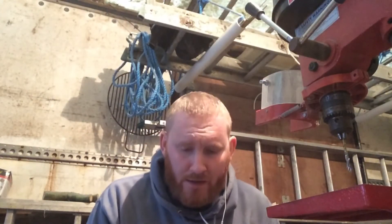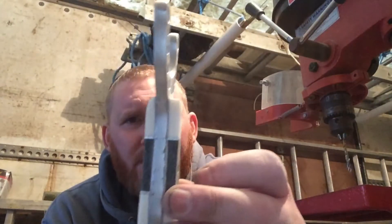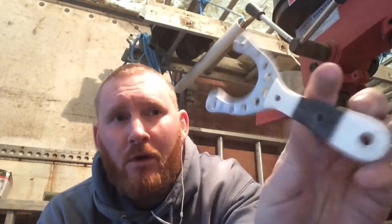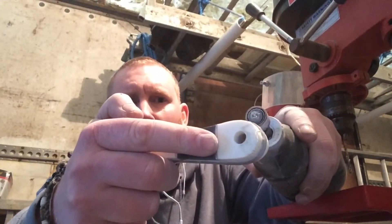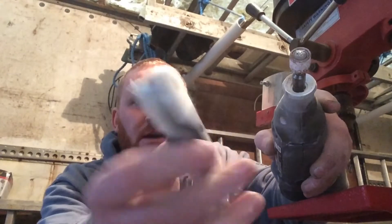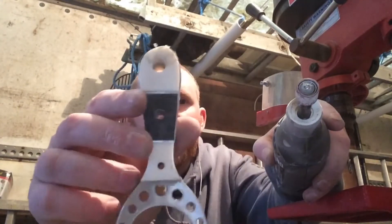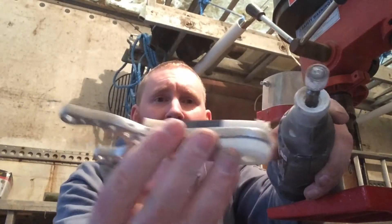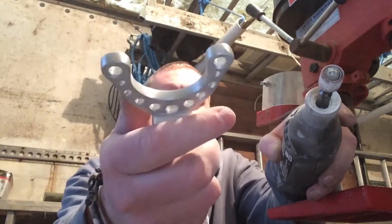Back again. The other side has been glued up and drilled — I'm very happy with it. One side has been shaped. First thing I'd do is shape round the sides with the Dremel, touching the edge of the core and getting it in bit by bit, section by section. Keep your eye on it, make sure you're level until you're all the way round. Once you've got it round and you're happy with the fit, then it's a matter of getting it level, because bone and buffalo is not always level. Getting the surfaces level, the angle you want, the shape you want.